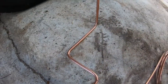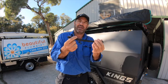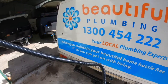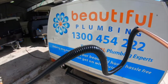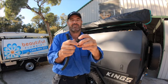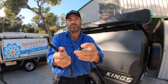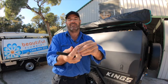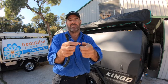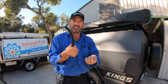The good thing about welding is you can sleeve it all. If you weld them, you can use this solid core sleeve - it's all the way protected, really strong and really flexible - and you just slide that over the copper before you weld it. The other stuff is this split corrugation; you push that over the last little bits so it'll push over a tee nicely. For the tee section you've got to use the split stuff, but the rest of it can be covered in the solid sleeve where the whole thing's protected with no way of falling off. That's why I like using it.